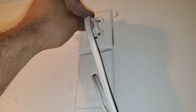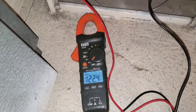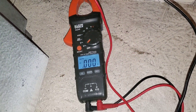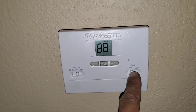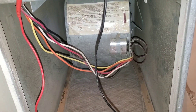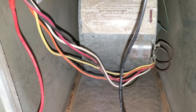Now we're going to reapply the 120 volts and make sure we have voltage. I'm going to engage my door switch — I can hear my condensing unit turn on and I can hear the refrigerant bubbling over, but my blower motor is not running. One trick I like to do is turn the system off and set my fan to on. By setting the thermostat to off and the fan to on, I'm isolating the system — I'm no longer diagnosing the full HVAC, just the blower motor. I engage the switch and my blower motor is still not running.